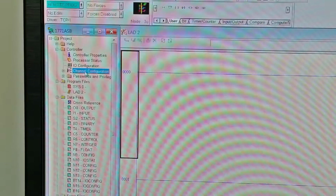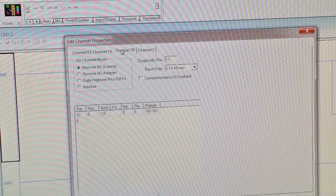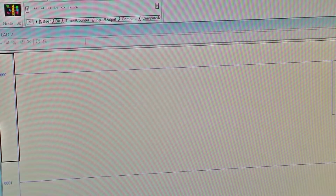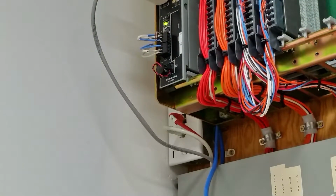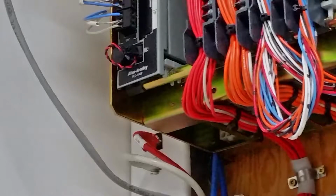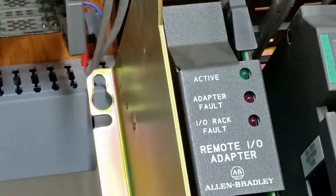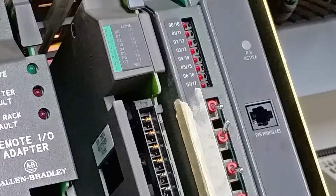Now we go back into the channel configuration, and we look into our channel 1B. And if we just take and delete what's there and say apply and OK, now if we go up and look at the processor, you can see that only the data highway light is on. The second channel, which is really hard to see at this angle, is off. So we come back down here, and if we look at the chassis, you can see no lights are on. The outputs are off, so we're in safe mode.